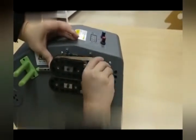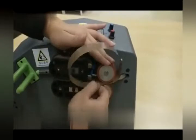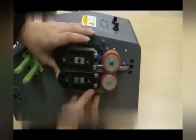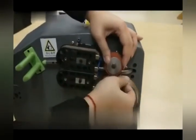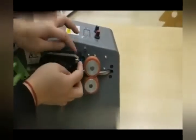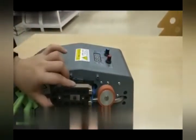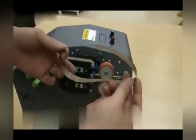You have the top and bottom belt. By pushing the subassembly forward, the belt loosens up. Then you can slowly nudge the belt off the wheel. Remember, the top wheel turns clockwise and the bottom wheel turns counterclockwise. You can turn the wheel to assist installing or uninstalling, but you should consider turning the way it's designed to rotate. This piece acts as the rubberish grip for the belt, and when the belt just rotates and isn't doing its job, that's when you should consider replacing it as well.